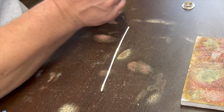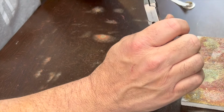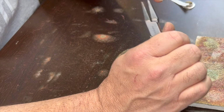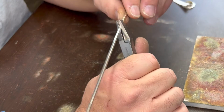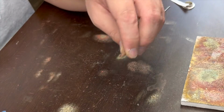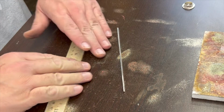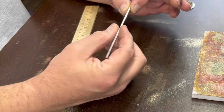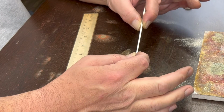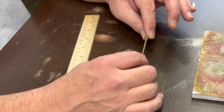Like I said, I've never made one exactly like this, so we'll have to see how it comes out. So first I'm going to straighten out this 12 gauge and file these flat. Okay, so to start with, I'm going to put a little twist, and I want to cordon it off here, and then keep the twist just in the center of this, just for decorative purposes, and also it'll make it a little springier in the long run.